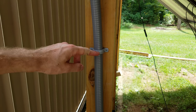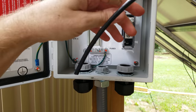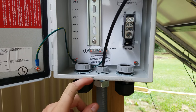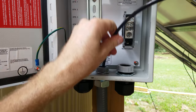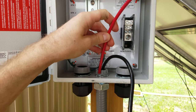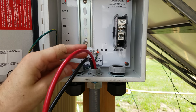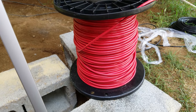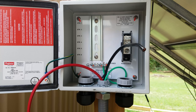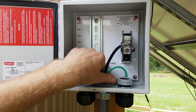For securing this conduit to the post, I'm going to use plastic conduit straps with 1¼-inch screws — about three to four of them down the post. For the wiring from the combiner box to the charge controller, I have standard number 6 THWN rated Southwire brand wire. I was told fishing this through would be difficult with three 90-degree bends, but it actually went through very well. The red went through very well also, and the ground wire had a little trouble getting caught on the fitting but pulled through fairly easily.